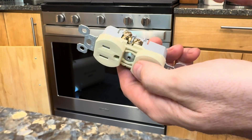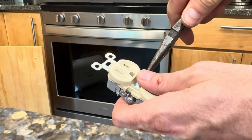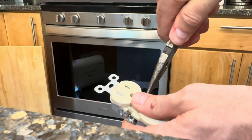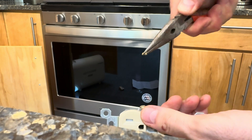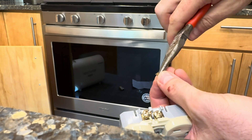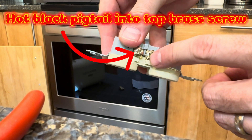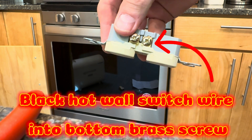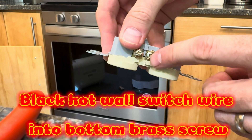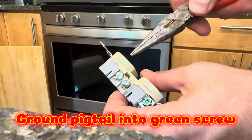I used a standard outlet and broke the brass tab on it — that part was important. I reinstalled a standard 20-amp outlet, not a GFCI. I broke the brass tab on the hot side, the black screw side. This separates the two plugs so they can each behave differently. I did not break the tab on the silver side — that was a big no-no, because I wanted both plugs to share the same neutral. I connected the black pigtail with constant power to the top brass screw — this powers the reverse osmosis system. The switched black wire — the one I found separately and had to remove from the push-in connector — I connected to the bottom brass screw to control the garbage disposal via the wall switch. The white pigtail I connected to one of the silver screws (either was fine since the neutral tab is intact), and the ground pigtail to the ground screw.